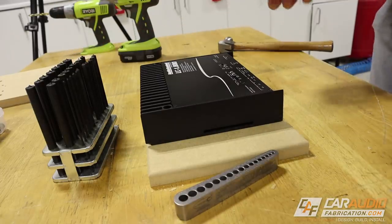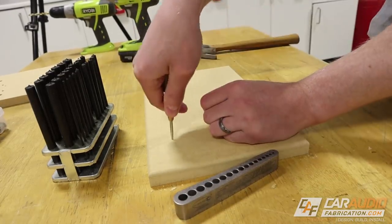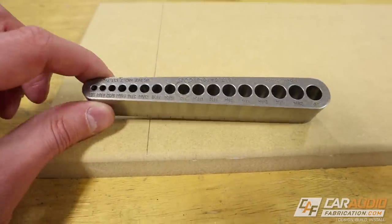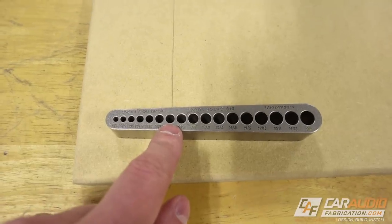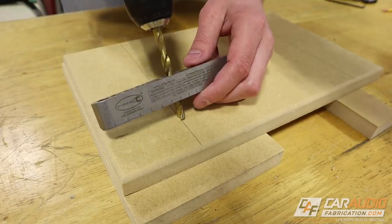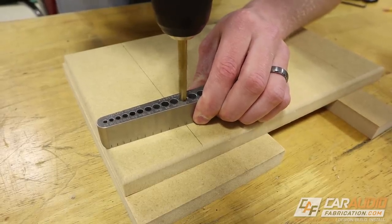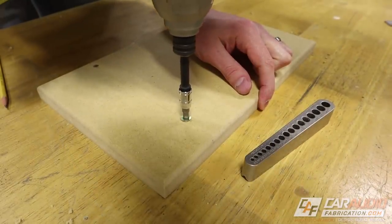To use the V drill guide, my process is the same as before — I start with marking out the holes using a transfer punch and then make them a little bit deeper using the center punch. Now here's where things get a little bit different. I can use a straight edge to make a straight line along one of those points and then take the V drill guide, line up one of these marks on each side, and now I know the center of that hole is perfectly on that line. But I like to do things a little bit differently — I kind of lift up the drill guide and then I align my drill bit into the hole that I've marked. I then push the drill guide down flat against the surface and proceed to drill the hole. I proceed to make all four holes using that method and then mount the threaded inserts much like before.